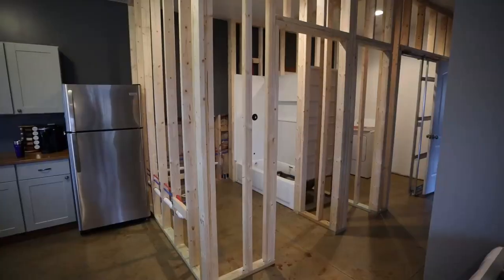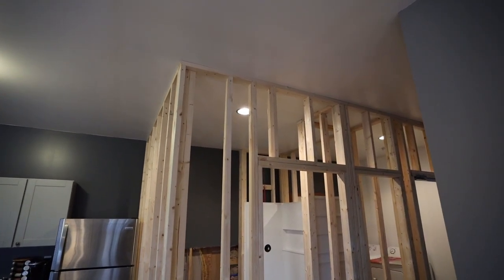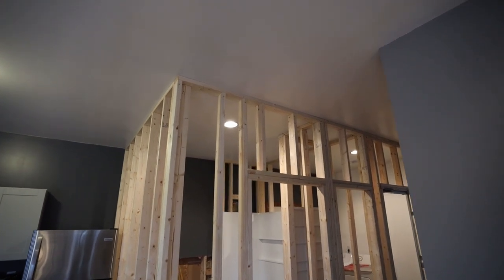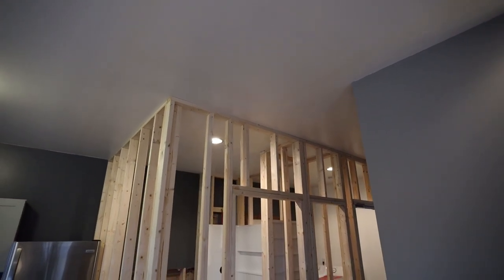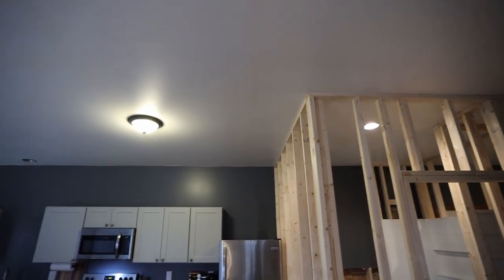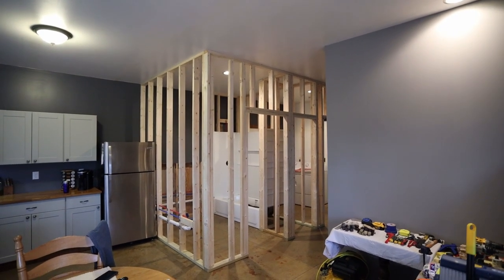And I think I'm going to be doing as much as I can from below, because I know I'll be doing obviously a lot of other drywall anyway. So I'll have to be filling holes where lights are coming out. So if I have to cut a little bit larger hole to be able to rewire this stuff, that's okay. And there is subfloor already upstairs, so that's gonna be a little bit more difficult to have to remove that. So I may just try to do everything from down here and then feeding wires through the trusses, because they go this direction. And then when they do get out to about this area, the subfloor ends and I can access the wires. So that's gonna be the basic plan for electrical. Now we can get started.